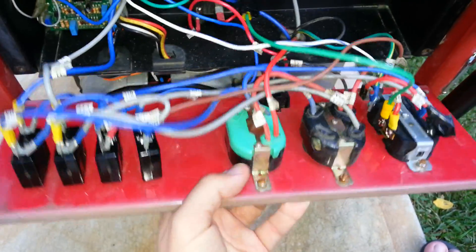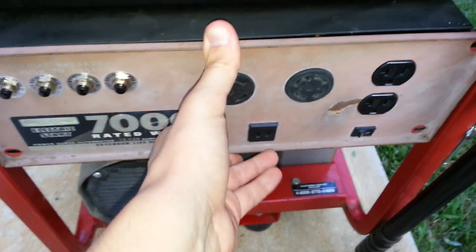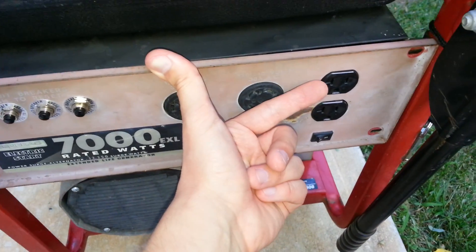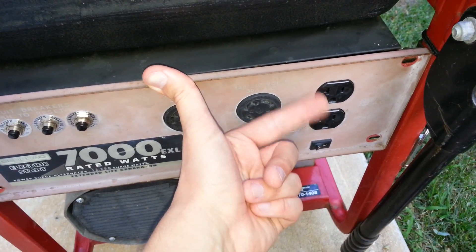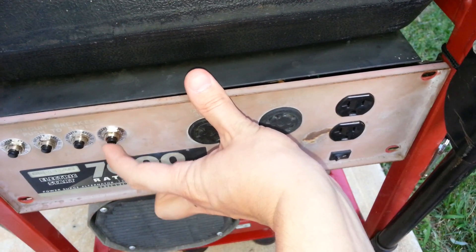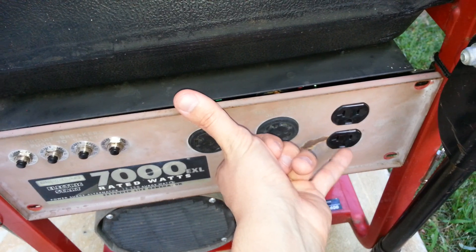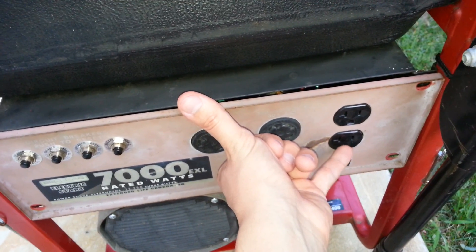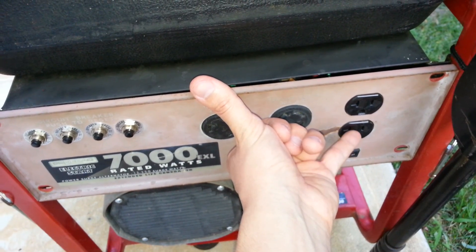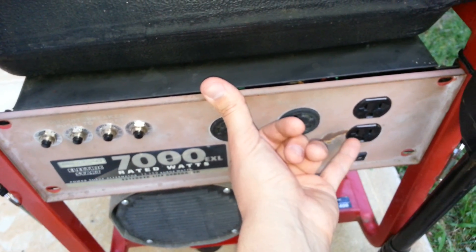This is the panel I took off. Everything inside has been tested and is fine now. What I noticed was with a 1500 watt heater plugged into this duplex outlet — each outlet has its own separate winding and its own 20 amp circuit breaker. Unloaded voltage is about 123 volts; fully loaded at around 1300-1400 watts it would drop to about 118 volts, which is acceptable and what I'd normally expect.